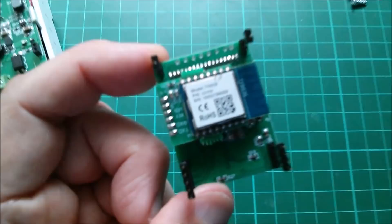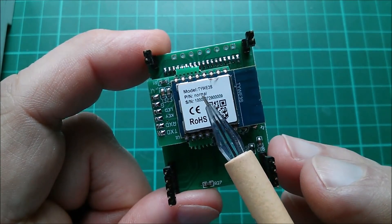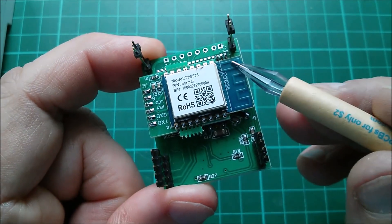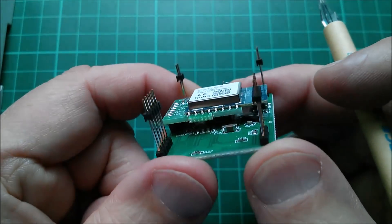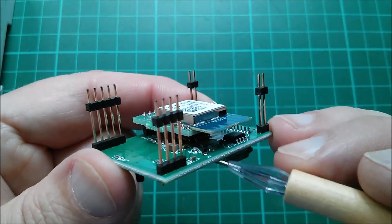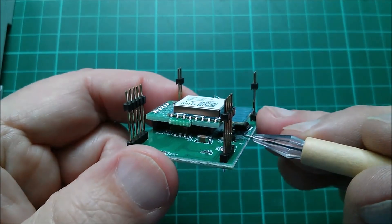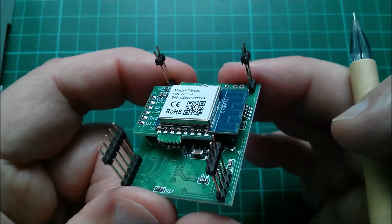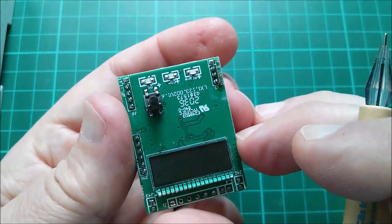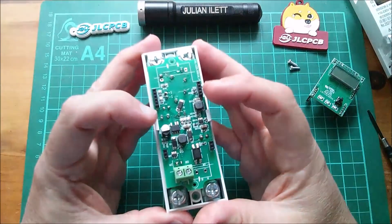Let's have a closer look at this board. We have a Wi-Fi module — a TYWE3S. That's repeated there next to the strip antenna. There is a microcontroller on this bottom board and there's X1 here at a funny jaunty angle — it's a sort of long thin black box. I'm assuming a ceramic resonator but it could be a crystal. On the top we've seen LCD, button and three LEDs. What do these say? Alarm, COM.